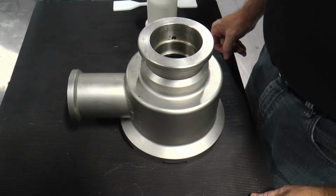Frequency of lubrication is dependent on the environment. Lubricate daily if it comes in contact with water or steam. Otherwise, lubricate on a weekly basis. The drive-end head does not have a bearing.